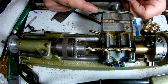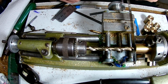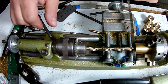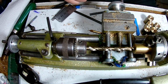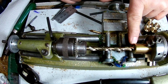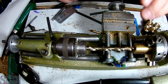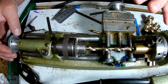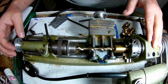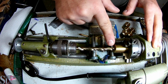And, you know, you can feel the friction over here. You lock the end over there, and then you know you're just 0.1 millimeters from the edge. Now 0.1 millimeters in my scale is negligible, so I don't mind about it. But if I wanted to, I could just proceed exactly 0.1 millimeters ahead, and then I'm right at the edge of the work.